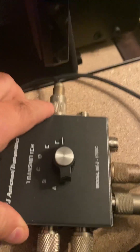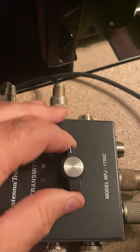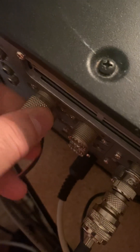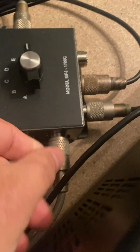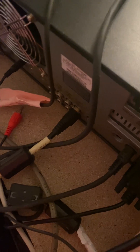The common port on the radio side basically routes RF for the LA-1K amplifier among whichever radio I select, and on the antenna side they can all equally share the HF auto tuner. For connecting radios — notice radio F here, labeled F — you follow that cable and it goes right into antenna one of the FTDX 5000. Basically you take a coax patch cable and go from each radio port to the antenna port on your respective radio.